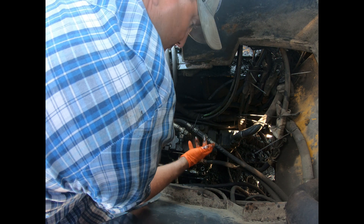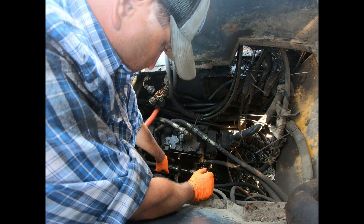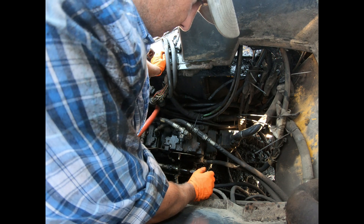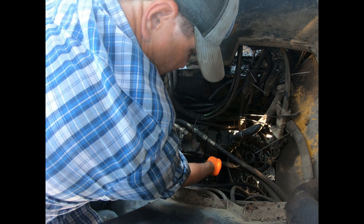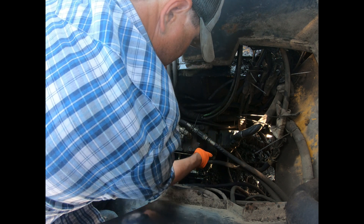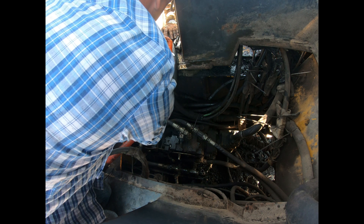So far, neither one of us have ever done this. Like I was saying, can't find anything online. Looks like this crossmember or brace right here — it's got a crossmember back here. If you've ever worked on a car or truck changing a transmission on something rear-wheel drive, you'll have a crossmember under the tail end. That's what this looks like. Where we're taking this loose, it also comes loose here — it's kind of L-shaped, flat on the bottom, comes up back here. Taking it out with an 18 and a 9.